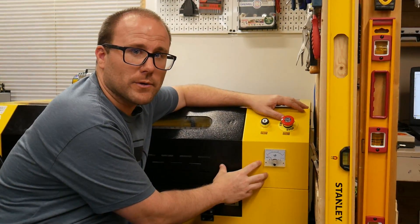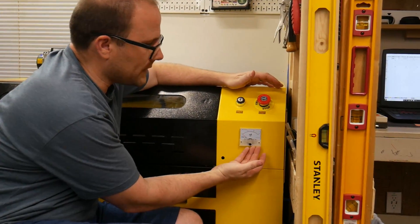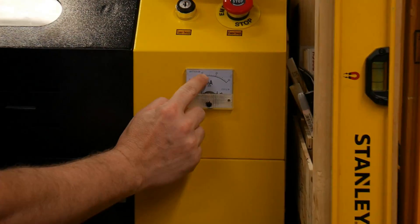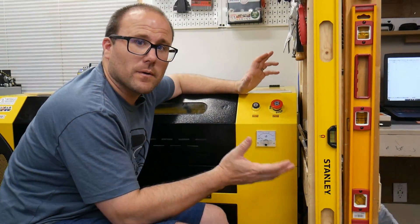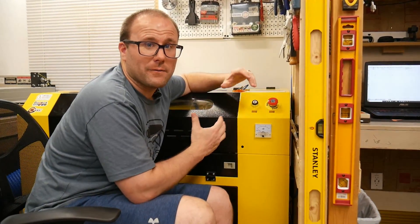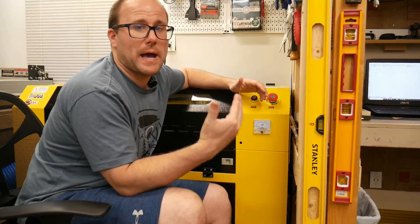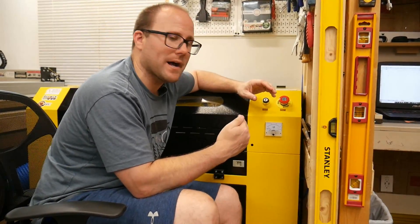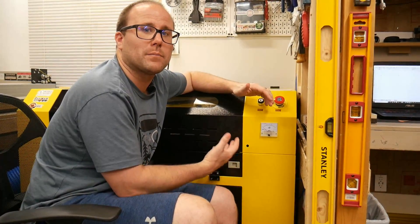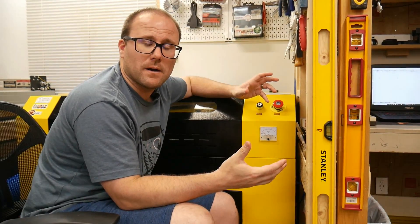That's how you install this milliamp reader into your laser. This will give you the proper output reading for that laser — we know now we want to stay within 20 milliamps or below. One key thing we did is get a 30 milliamp reader so our resolution is higher. If you went with a 50 milliamp reader your resolution would be smaller and harder to distinguish individual lines. I suggest getting a 30 milliamp or lower, especially with the 60-watt which we now know is actually a 50-watt. Stick with an analog meter — it will show you real time and you don't have to connect an extra power line. The digital one requires a 5-volt power connection and it lags behind, so you can't monitor in real time. This is one time when analog prevails over digital. Hope this helped — hit the thumbs up, leave comments below, and please subscribe. I'll come back with more laser tips and tricks. Happy lasering!